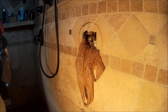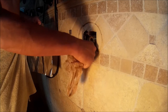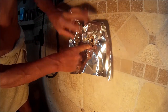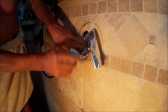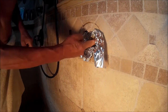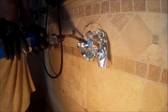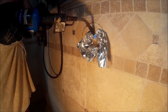Okay, so the outer part of the cartridge is still stuck in the wall, which is the most important part of it. We've drained most of the water out of the faucet, and now we're going to get a piece of tinfoil and create a heat shield. We're going to use a torch and heat the outside of the cartridge, because it's screwed into the inner part of the cartridge, and that heat differential should break the bond of the rust and make it much easier to remove. Because there is insulation in the wall, wood shavings, and 2x4s, we want to protect the wall